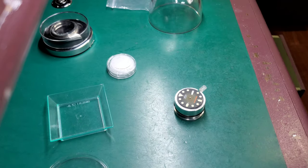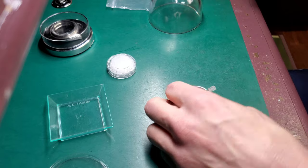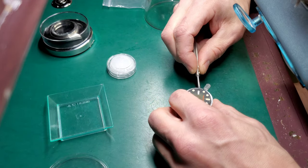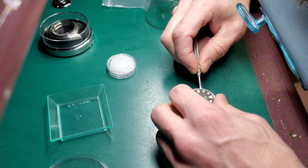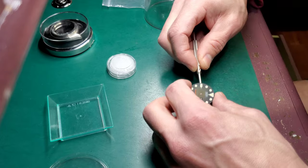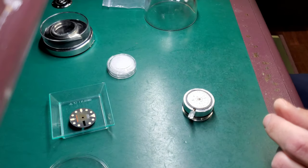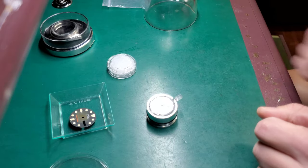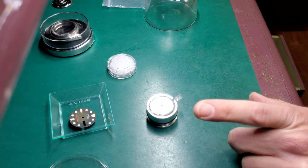And that's not a very hard fix. The date wheel is a little more difficult to change than the day wheel. The day wheel just has a little tiny clip on it and pops right off. The date, you've got to take plates off, get the movement holder off, and all sorts of things. So I'm going to grab the new day wheel.